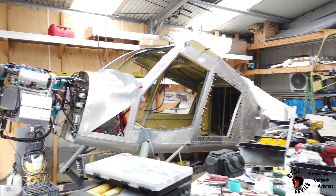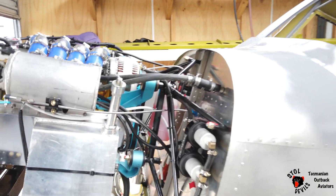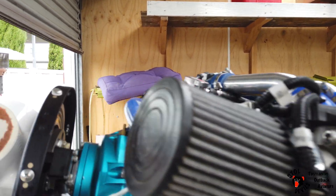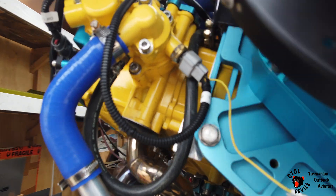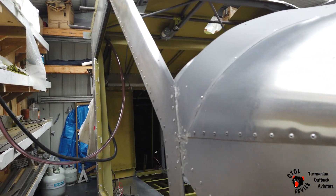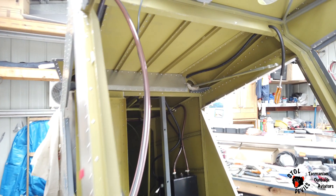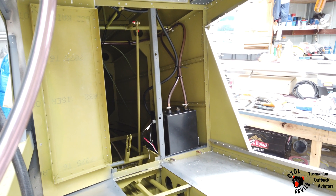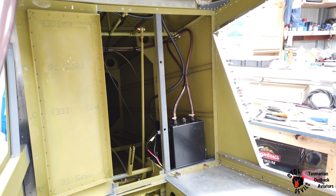Hornet update into January. The last three or four days we've completely finished the wiring and plumbing of the engine. The heater core is all plumbed up, all the wires are covered. Still got to put in the temperature probe and the wire for the gearbox oil temp, but she's looking good. We completed the fuel system — the aircraft fuel tank feeding the header tank down below. The aircraft is now running on its own internal fuel system, which is great. No leaks — there was one small leak at the front but we fixed that last night.